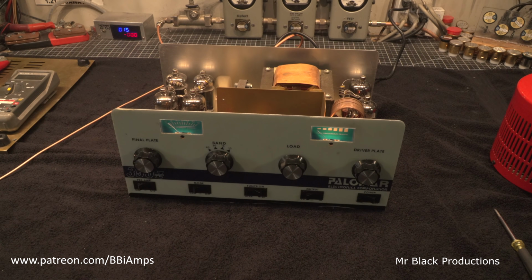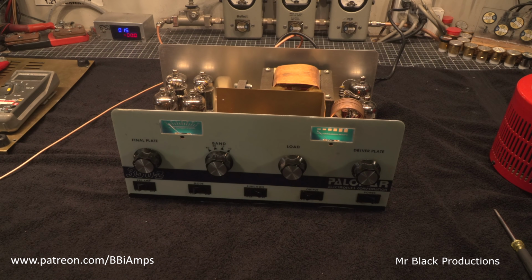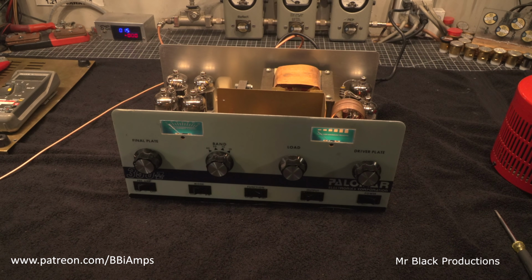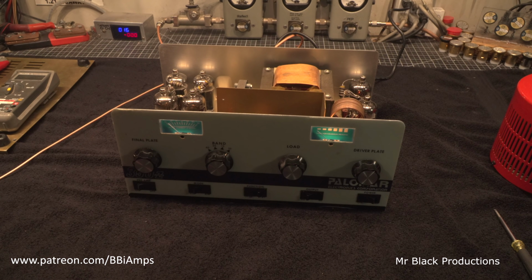See these old girls? We can still get the tubes. That's about it. So if we start burning up parts, it's kind of a stretch to find the parts. So, I mean, that's that. It doesn't look too bad on the shop receive radio over there. It doesn't look too bad on the spectrum analyzer, but that's not what anybody's here to see. Right now, with the condition of these tubes, we got ourselves a 600 watt sweep tube box. Like I said, with brand new 100% tubes, you probably pick up another couple hundred watts. Make a cute little driver for somebody.